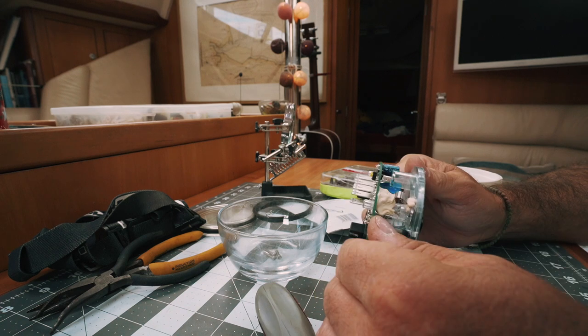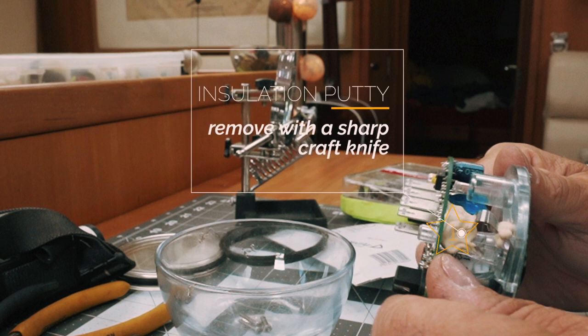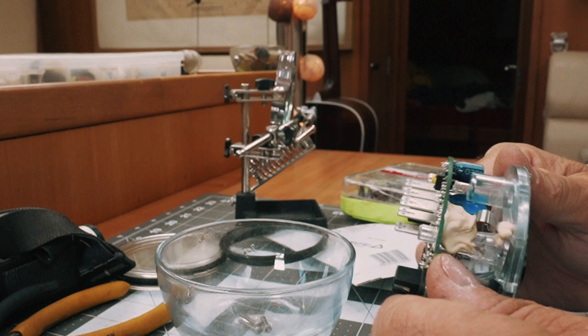With the electronics exposed, we now need to remove the old LCD panel and the ribbon connector. On the Yanmar panel there are blobs of insulating putty that look like old chewing gum. This is where your craft knife comes in super handy — you have to very carefully remove all the excess insulation putty. Using a very sharp tip knife and taking obvious care with fingers, slice away at all the putty. Be aware you don't need to be overly cautious with the ribbon connector as you are replacing the unit in its entirety. On this panel, insulating putty had to be removed from two places: blob one is where the ribbon connector connects to the circuit board, and area two is where the ribbon connector passes through to the front of the LCD panel.